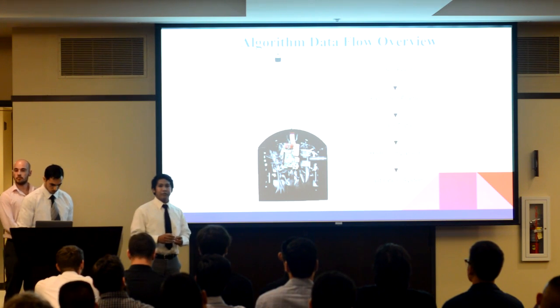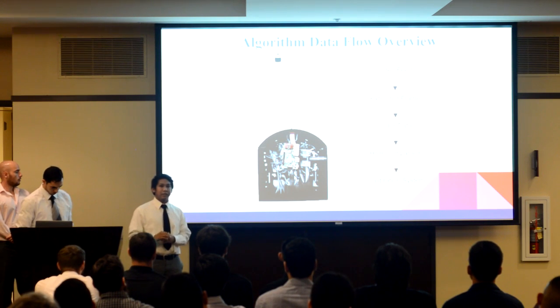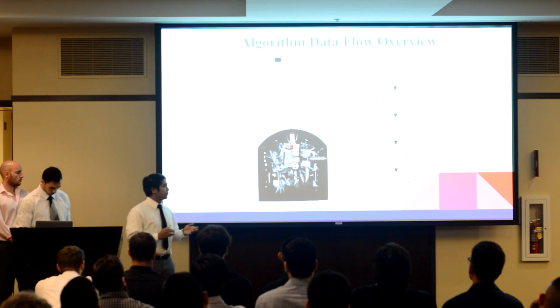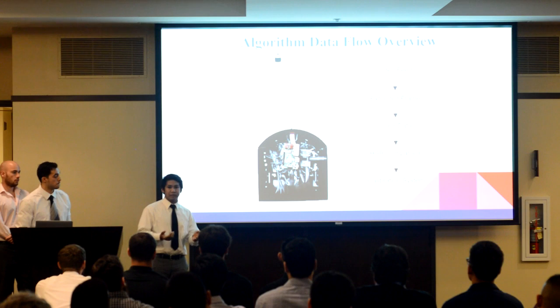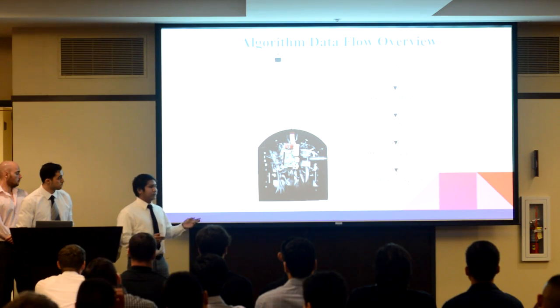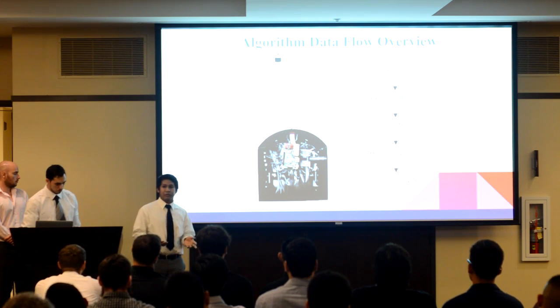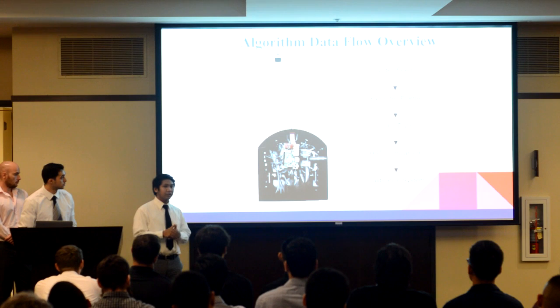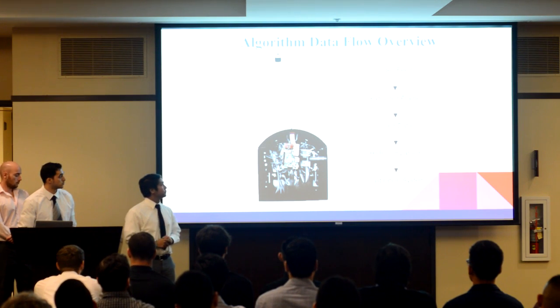HSB is a derivative of the RGB color space. However, it's mainly used to define the brightness of the pixel rather than its color pigmentation. It's important for infrared frequencies because infrared actually lacks any type of color, whether it's red, green, or blue. That data is then passed on to our calibration system, which involves the PIC microcontroller to make the appropriate maneuvers in order to get an accurate shot for our extinguishing system.